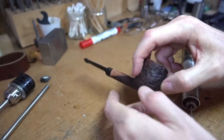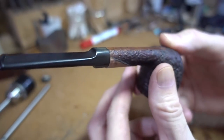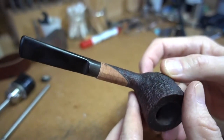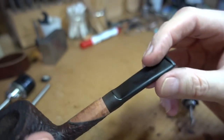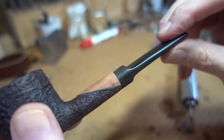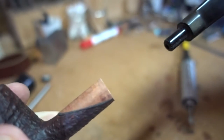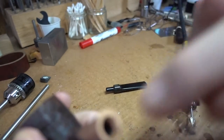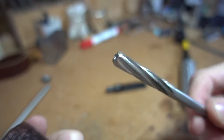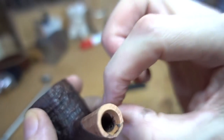I'm back from the belt sander. I've also used the disc sander and a small amount of lapping on the square flat table to get the end of the shank right. The fit is pretty good, and all that was necessary was to take this chucking reamer and just clean out any epoxy that had oozed into a bead along the edge there.